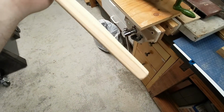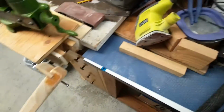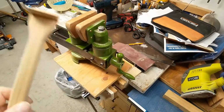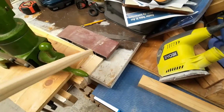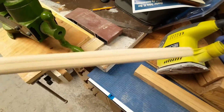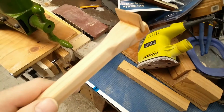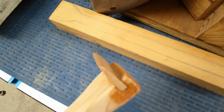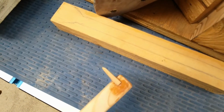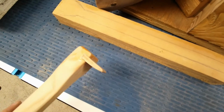Well, it's trimmed and sanded. Got it nice and smooth. Ended up using that and my carving vise to hold it as I was doing some of the rough sanding with the 80 grit block. And then used this thing with, I think, probably 220 or something to do a finish sand. And that gives a nice blade on it. It seems like it works good through a shirt.